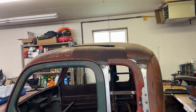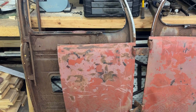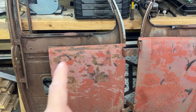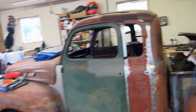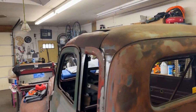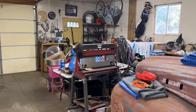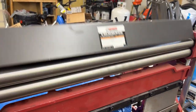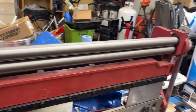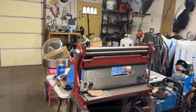Instead of using that piece I've got laying around, I'm gonna try to use what's left of these door panels — the external skins. These external skins have kind of a little contour to them, and the roof also has a contour. I don't have an English wheel, but I do have that Harbor Freight 3-in-1 that has the shear, brake press, and a little roller, so I can roll metal and give it a bit of contour. Or I can use the old-fashioned way and just bend over my knee.